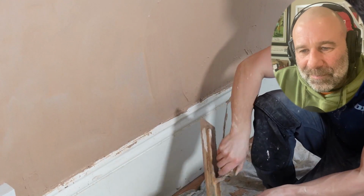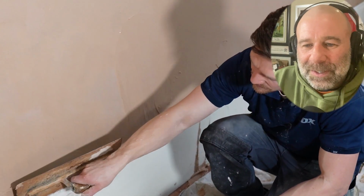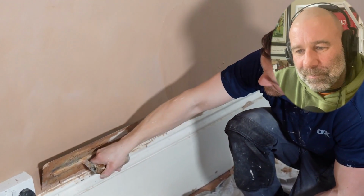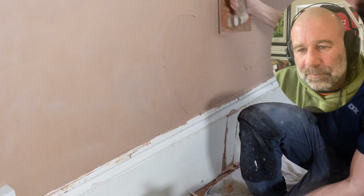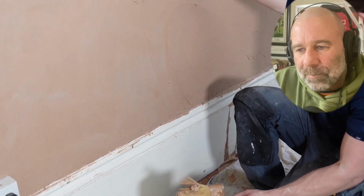And, as we go, you think about maybe potentially cleaning your trowel in the later stages, we start cleaning. But just focus on, if you've got an area that's been a bit stubborn or there's a few gaps, just focus on that one spot. Rather than coming all the way up, we can just focus on, right, got a little low spot here, fill it.